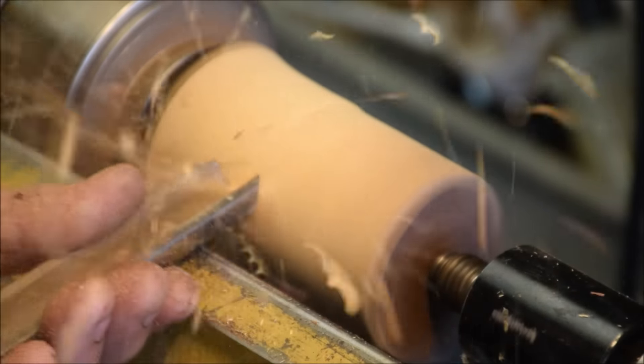Now I'm using my narrow parting tool in order to remove the two rough ends and get this into a shape I can start working with. I love this little step center — it's great. It's got a spring-loaded point and these little serrated teeth. If you get a bad catch, those teeth act like a saw and cut a slot, so your piece just spins instead of getting a real bad catch and grab. These are very good for beginning turners. I think I picked this one up for about $29 — I believe it was PSI.